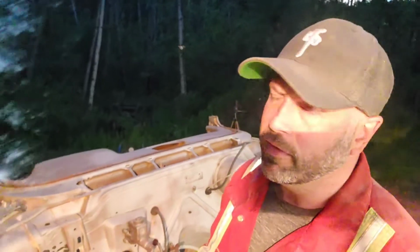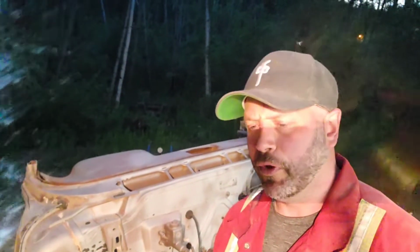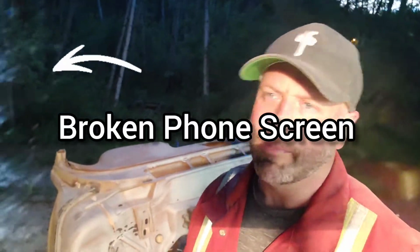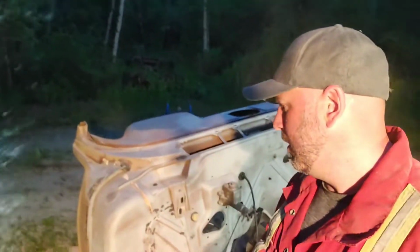So going to the city this weekend, probably pick up some more bags of 3060 crushed glass to get this project here finished up. I'm going to pick up a couple bigger tips there too. I finally have access to Princess Auto, the store, where I can get sandblast stuff and things I need. So I'll pick up a bigger tip there too, so I can run the copper slag through it. See how that works with the bigger tip. And then the silica sand and the 2030 crushed glass, which is a bit coarser as well. So at least I'll have a bigger tip. Should go through it pretty no problem. If it doesn't, I know the 3060 crushed glass through this system here does a really good job.